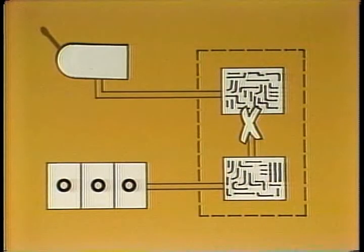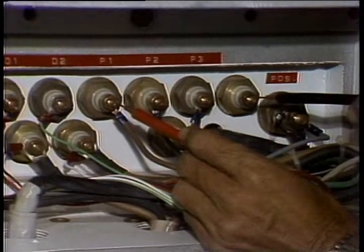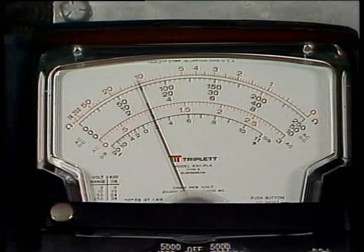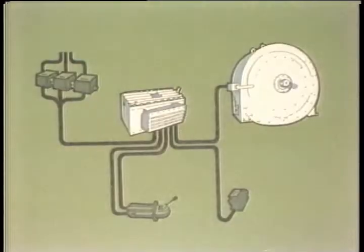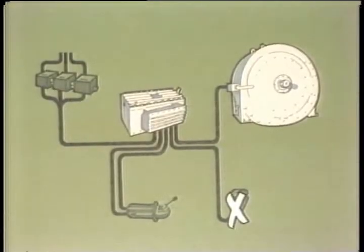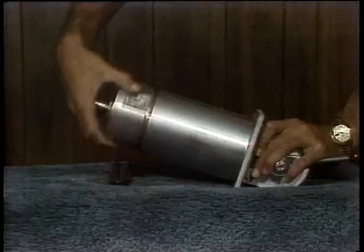If the control voltage doesn't check out, but the driller's control output is good, you can logically suspect the firing module. The voltage across P1 and C should be minus 15 volts DC in any position of the power selector. If any subsystem except the SCR bridge doesn't check out and you've eliminated cables as a problem, replace the faulty subassembly. The power selector switch is easily replaced.